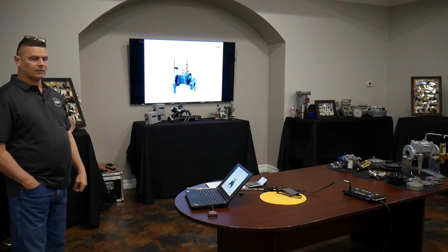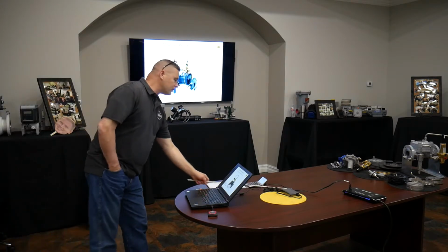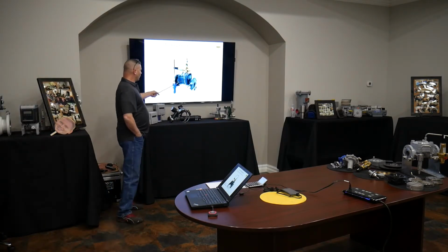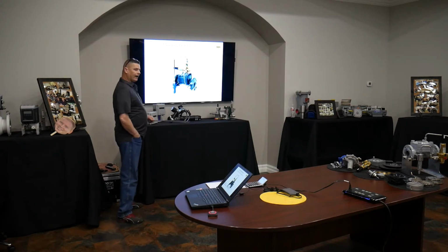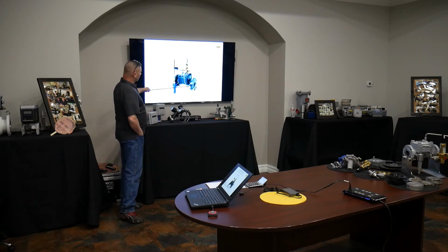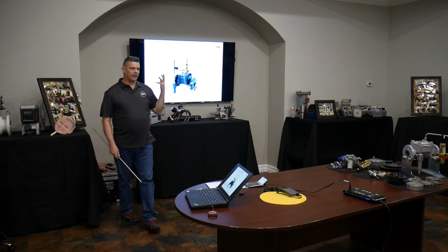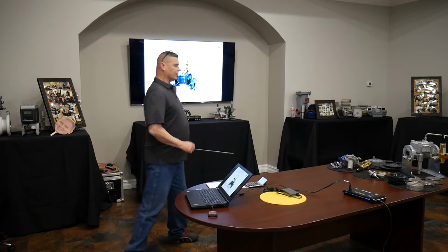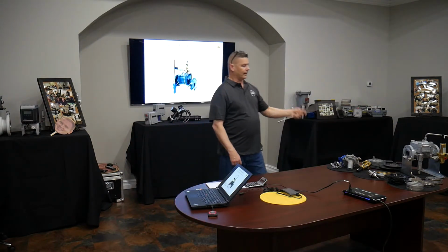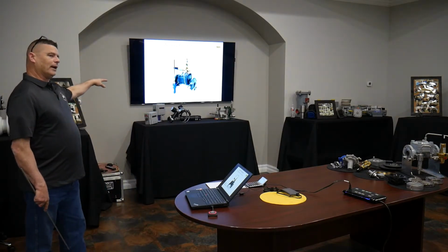Because it's easier to work on a Mooney regulator in the event that there's basic maintenance, because to do work in the body, just to inspect the diaphragm, put a rebuild kit in, I have to disconnect my outlet line, my inlet line, and my sense line, and the pilot comes off with the spring case. If I do it side mounted like that, I've got one thing to disconnect, and that is simply my loading line on top. And then I'm into the body. So that can be a benefit, not so much the way it's shown here.